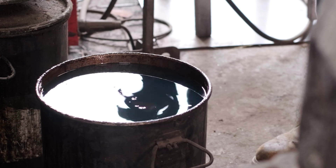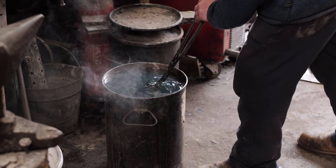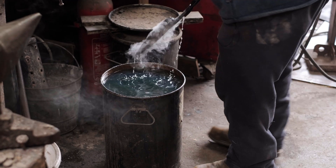On the carbon steels it's a bit different. What I do: I quench it into oil until I know it's well below that — the knee as we call it — so well below 600 degrees. And it's very simple: oil sitting on a piece of hot metal will automatically ignite. If any of you watch Forged in Fire, you'll know those guys love to make their oil catch fire while quenching. That oil will auto-ignite at about 450 degrees. So if I lift my blade out of the oil and it doesn't catch fire, it is below 450 degrees.